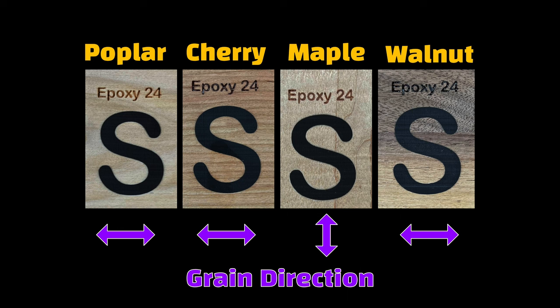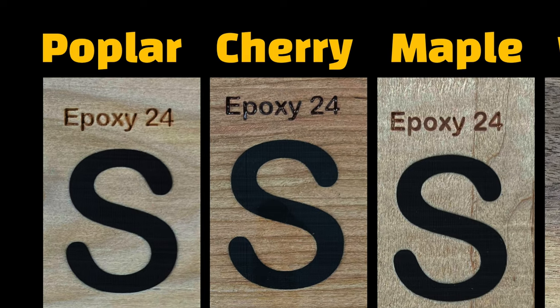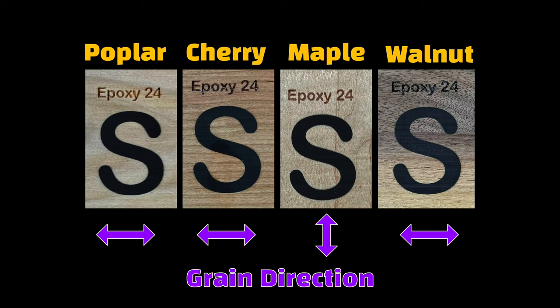In the next sample, the wood is sealed with the epoxy that cured for an entire day. As you can see, the results are essentially perfect — zero bleed across all the woods. The one thing I will note, however: you can see the engraved names are full of cured clear epoxy. If I had poured the black epoxy there, you would undoubtedly see a lot of burn-through where the clear epoxy filled the engraving and the color epoxy didn't penetrate. So if you're doing a lot of fine details, a thick epoxy seal coat might not be your best course.